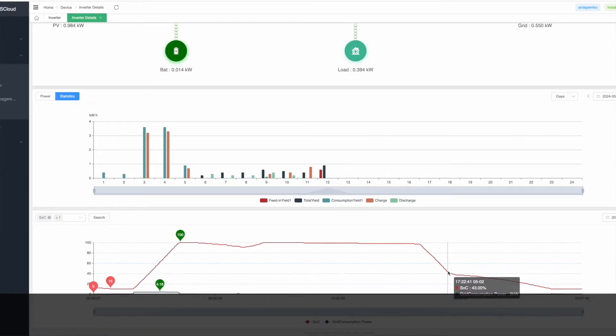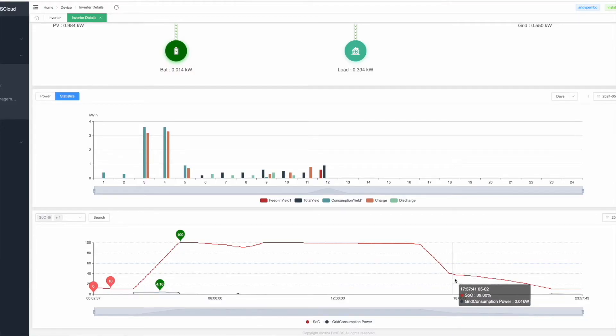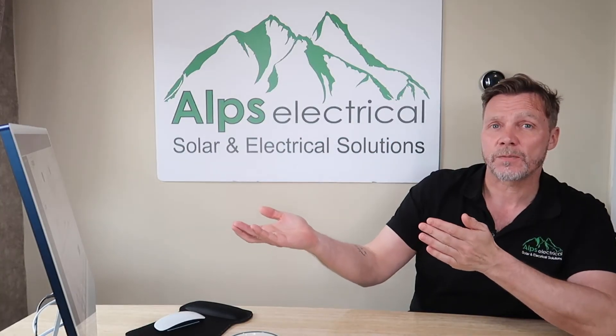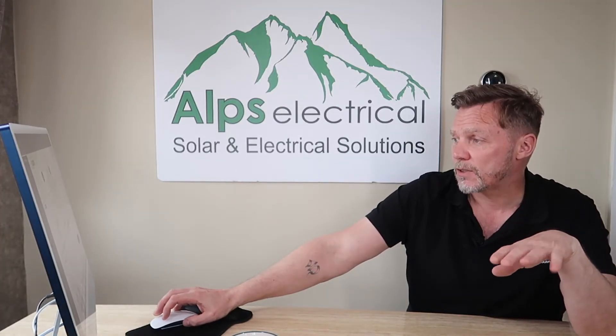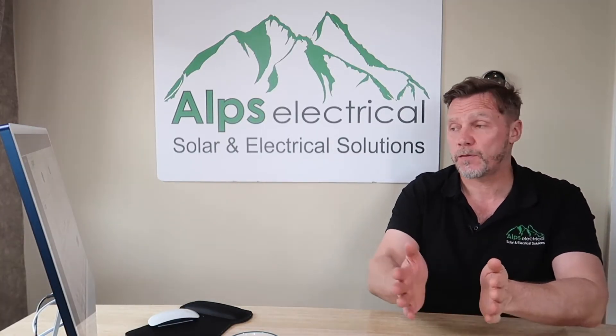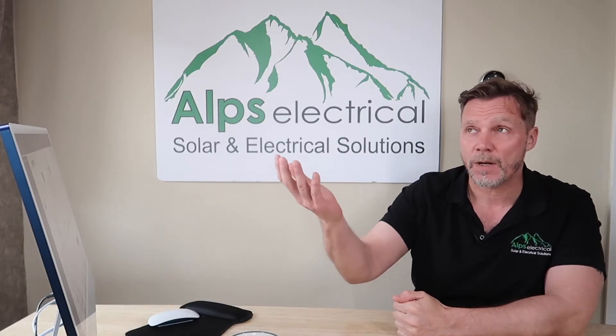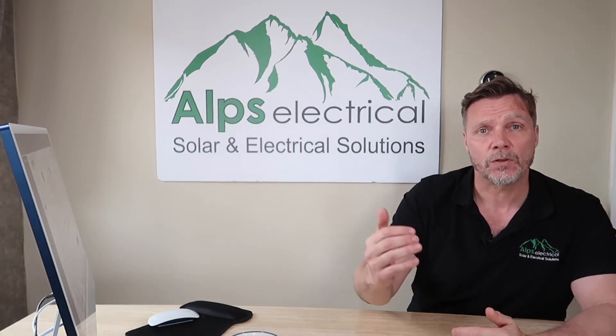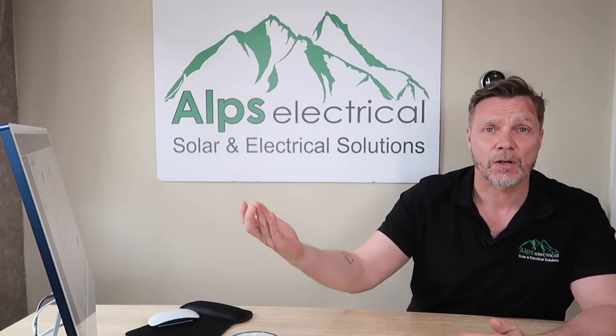Other customers may want — if you've got a good orientation and you're still generating between 4 and 7 — you wouldn't necessarily need to set your discharge between 4 and 7. But what you can do is set your discharge before you go to bed. So if you're on Octopus Flux, you could set your discharge at midnight if you've got good generation between 4 and 7pm. I'm doing it because I'm not getting the export, so I want to capitalise on that period.